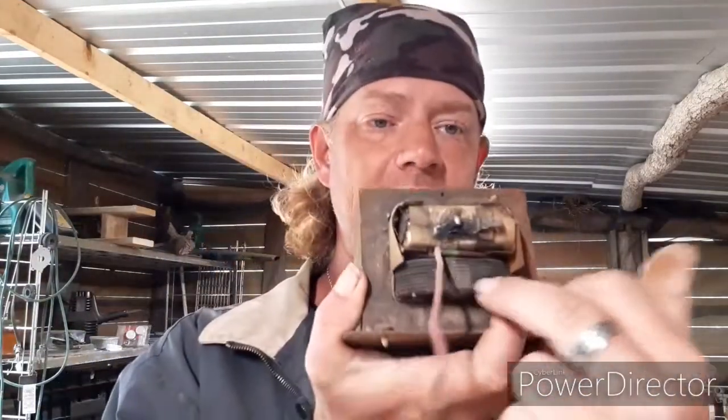you have your primary winding, okay, and we'll go into a secondary winding and try to get at least 2 turns in that. The more turns, the better, but it's a lot thicker gauge wire, so currently this is thinner gauge wire. Now, when you wind, the more you wind, the higher the voltage is. Now, the bigger the wire that you wind, the more amperage it'll pull or push. Let me go ahead and get these welds cut and get this thing opened up, and we will go into building this thing.